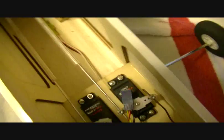Okay, guys, we are completely finished. We've got our battery mounted back here. Lead runs underneath there to the switch. And let me turn this around. We got our receiver mounted right there on the foam. Got our wires all nice and tucked up. We put one antenna up the side, the other one back. You want to try to get them in a 90 degree L angle if you can. So we glued this one through a piece of heat shrink where the antenna will actually still come out. That way, if you have a crash and your receiver gets chunked loose, it won't rip your antenna out, it'll pull out of that. The other piece is just sticking down underneath there, toward the back, and this side's up. So we're in a 90 degree L shape.